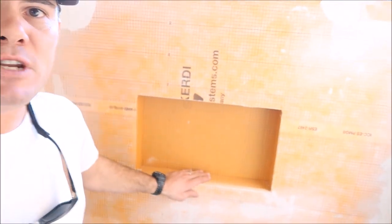We buy the Schluter shower kit, the drain assembly, which is a tileable drain, a recessed shampoo niche, and for your substrate, your backer board, 4 pieces of drywall, green board, and a bag of non-modified thin set, $20. So, the true real cost for a typical size shower for a Schluter Systems, 100% waterproof, vapor tight, with a warranty.